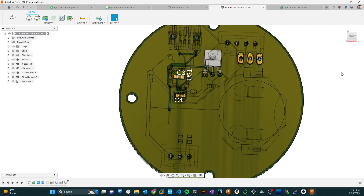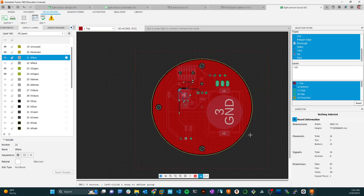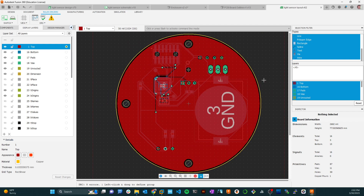Routing is complete — that's good enough for right now. By the way, you can come over to the layers panel and turn off the top layer to look at the traces on the bottom side. I'll turn that back on. I'm going to stop the video here, and next time we'll come back for another step: cleaning up the silk screen. Otherwise the board vendor will truncate all those silk screen labels, and some of them — like the big one for the crystal — are just annoying, so we'll turn those off. We might even add some text to the top describing what this board is. More next time.